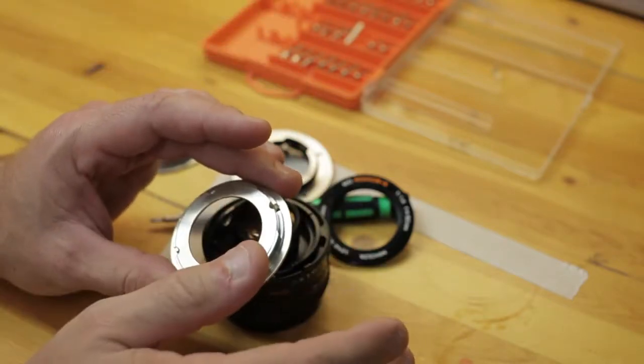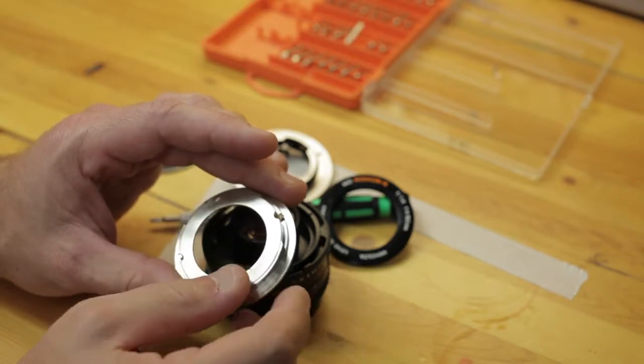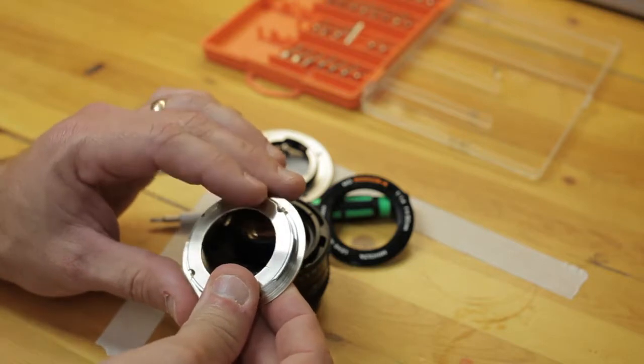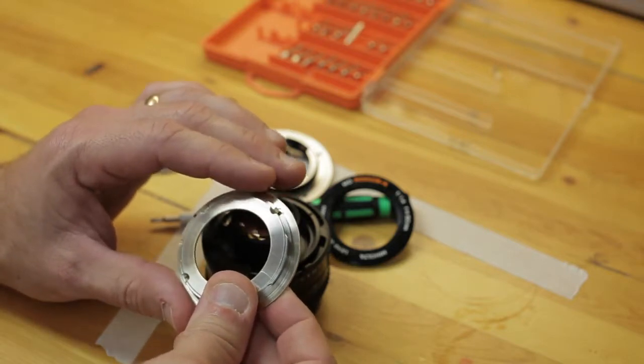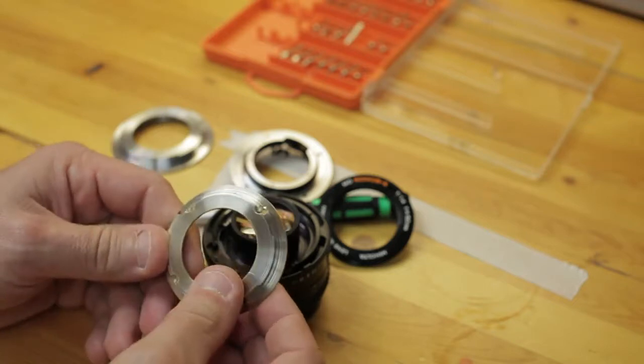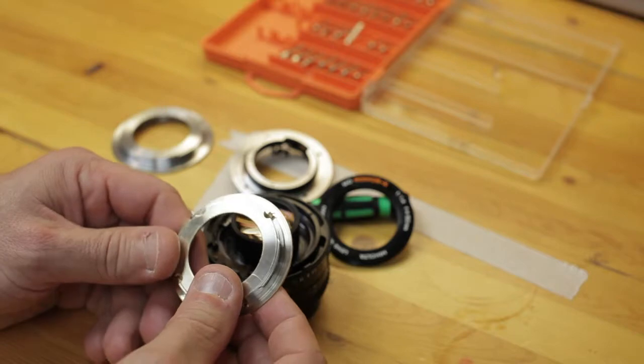You really need a mini CNC machine with some good end mill bits. I ended up investing in a $25 5/16 inch end mill. It's a 4-flute design, and it works quite well at 3100 RPM, fastest spinning rate on the drill press.